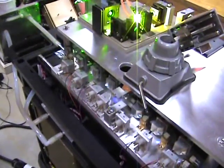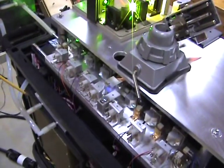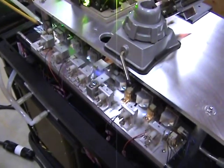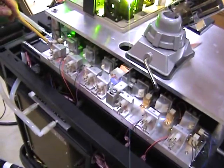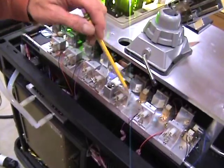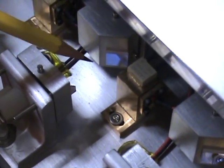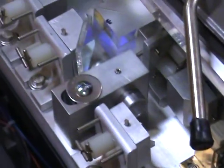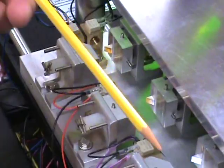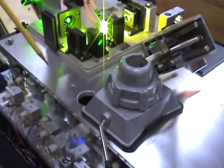This module, which has been completed, isn't quite as over the top as the dye laser, but it does have some neat features. To begin with, it's water cooled — there's a water cooling circuit that cools both the laser base plate as well as the driver base plate. There's also an unusual setup with the diode mirrors. These are M-series diodes collimated by Rochester 4mm aspheric lenses. They're impinging on a mirror or cell here, which on the other side of the laser — because it's inverted — you can see the diode hitting a primary mirror right in its center, which very accurately positions the laser spot on the prisms on the opposite side. This allows me to maximize compression of the laser beam and minimize any vignetting or shadowing before the two beams converge in the cube and are then launched up to the upper deck, where the beam shaping optics will allow this to be mixed with the yellow beam.